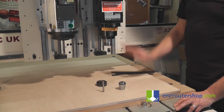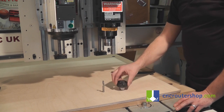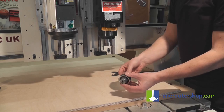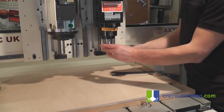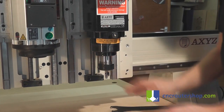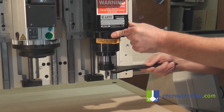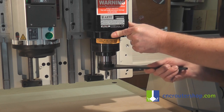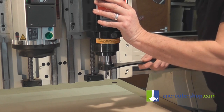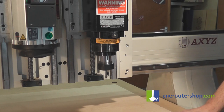To assemble the parts on a 5 horsepower LT spindle, take the nut onto the collet and place the tool into the collet. Screw it onto the spindle finger tight, and now push in the lock button. Same principle as the HSD spindle — if you over-tighten these, it will damage the tool. Just enough. There you go.